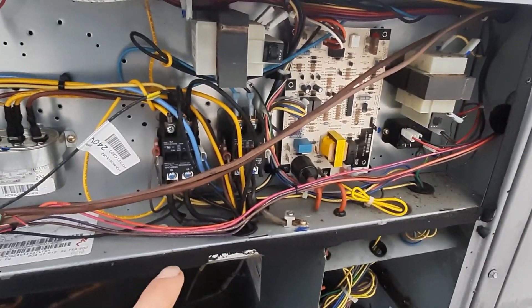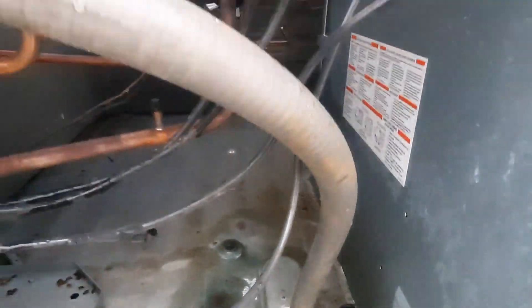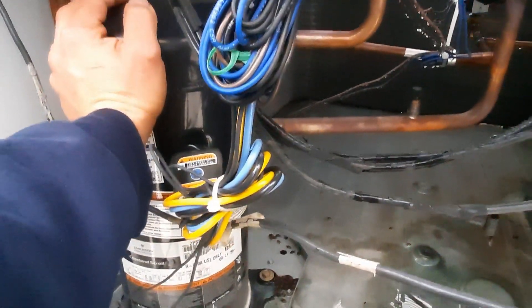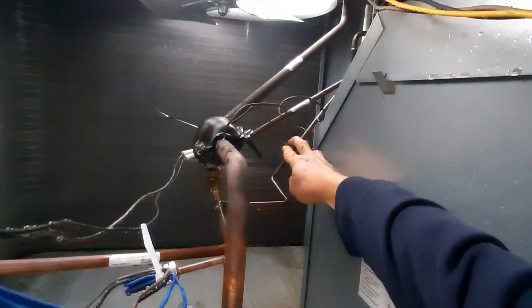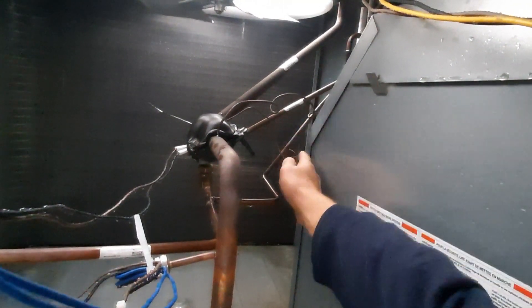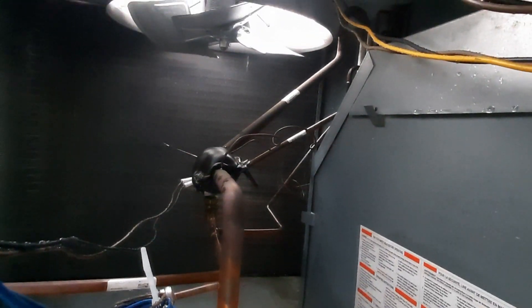Nothing's tripped, I got no screen, no low voltage trips there. That's not a good sign - that compressor's warm. We may have tripped a breaker. We got the usual Carrier cap tubes rubbing - it doesn't look like it rubbed through, and I don't really see any oil so that's a good sign maybe.